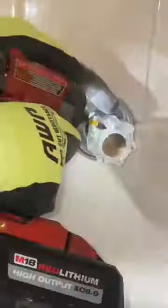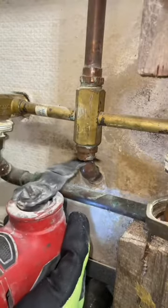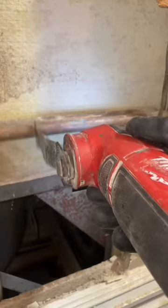I don't know if you saw this, but whenever I started cutting the wall the first thing I found was electrical wires — both new and old. There's knob-and-tube literally right behind this faucet. Water lines come up from the right side and they 90 directly over, so I'm gonna try to replace as much of this as I can because we're probably gonna have just a smaller access panel behind here, so I want everything to be new.